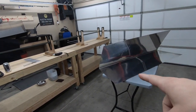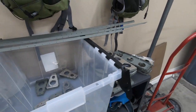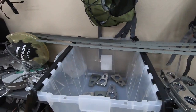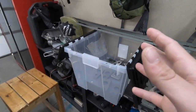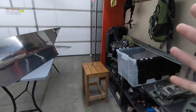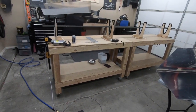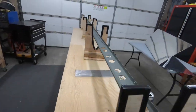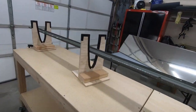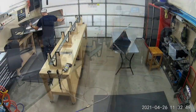Today we'll knock out dimpling on the skins. You'll see here I have a stack of parts that are primed. What I did, which I'll get to later on, is I made sure that any mating surfaces were primed, and then anything towards the inner edge or outer edge — anywhere moisture may collect — I primed as well. This middle spar here is going to be fully primed. We'll get to dimpling and start building an airplane part.